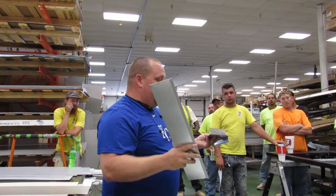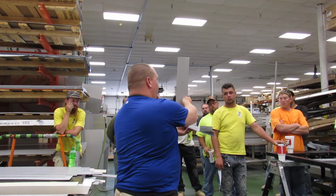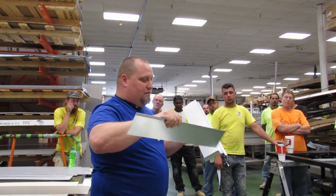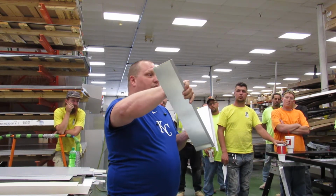We've had some where we've done this and just done a straight butt joint on this side, just like this, and caulked it. I mean, we're just relying on caulking. It doesn't seem like much, but when this tab is up and you put caulking on this tab, it is that much more protection. So this is what we expect.